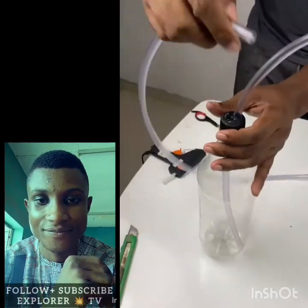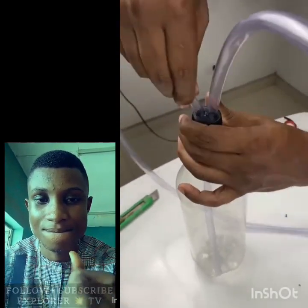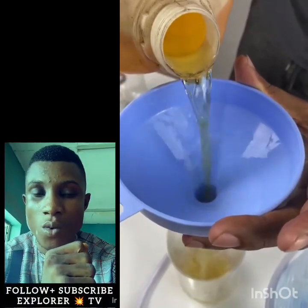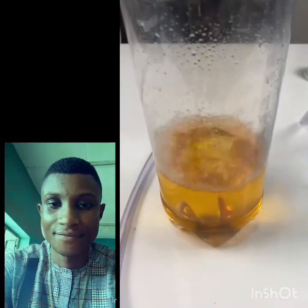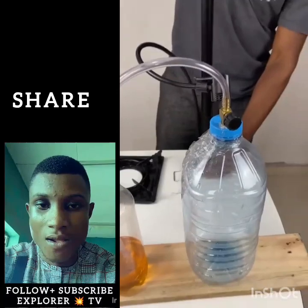You will also drill two holes in the tops of these bottles, two holes the size of the level hose. In one of the holes will go the end of the hose that should reach the bottom of the bottle. In the other hole will go another length of leveling hose, which will only carry the pressure and gas from the bottles and gallon to the stove. Don't forget to seal these holes in the bottles as well.